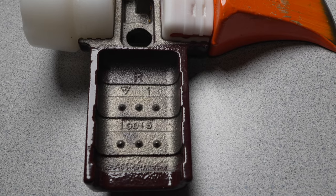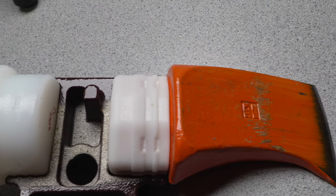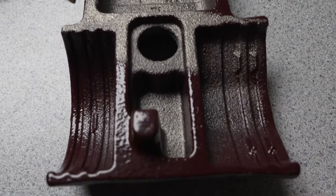The second thing I like about the Halder design is the bolt-on handle. The head is of a clamshell design which bolts onto the handle. It is very unique as I have never seen this design before. In my opinion, this is a much stronger design than traditional designed mauls and axes. This design is not dependent on wood wedges and friction to hold it in place.